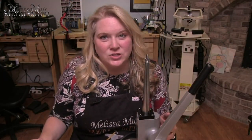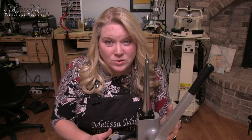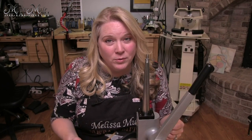So you saw that was pretty easy to do that reducing. Because this is my filming station, this is not permanently mounted — I've got this mounted with a couple of C-clamps. But whatever you do, you want to make certain that you've got this mounted so that you can give some force to it. I did not use a whole lot of pressure — I'm sitting at an awkward angle because I am filming, and it doesn't really require a whole lot. The more pressure you put on this, the more movement your metal is going to have. Another thing to keep in mind is that you should always have your metal annealed when doing this — if you don't, your metal might become brittle and is more prone to breakage.